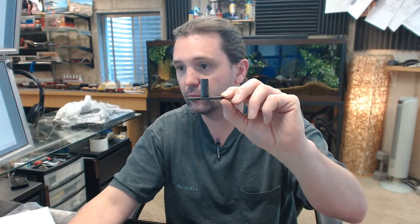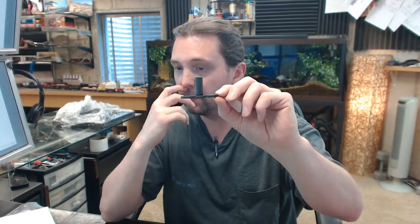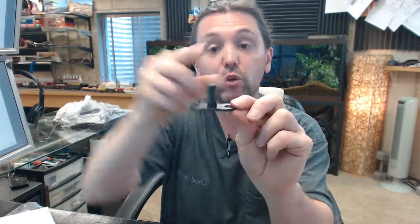So step 3, you've got the radius or you don't, and you'll have to sort out if you don't. You're going to fasten the top pivot to the top of the door, and per the installation instructions, it's not really specifically called out, even though it is on the template. You want 1 1/16 from the edge of the door to the center line of this. Now that should be what it would be if you simply flushed the edge of the top pivot off, and it indeed is. When you look at the installation instructions, it basically shows that you're going to flush this off with the edge of the door, and when you do that, you'll have 1 1/16. It's crucial to get that correct.